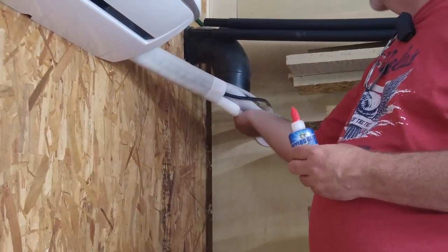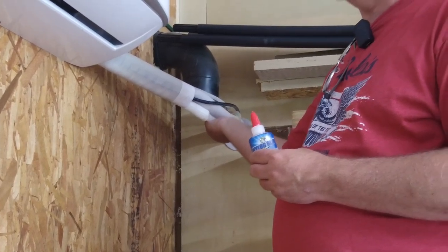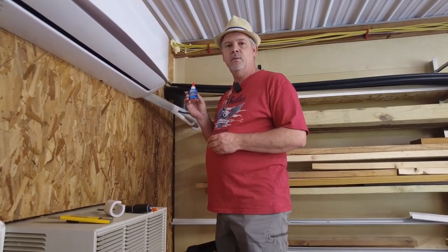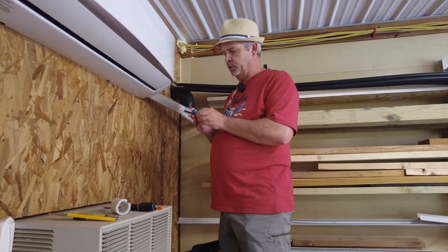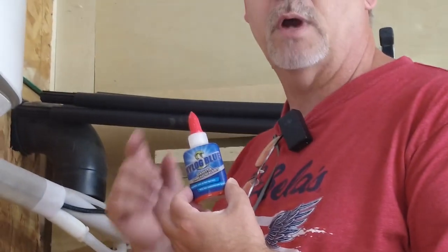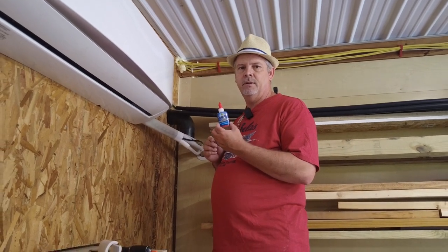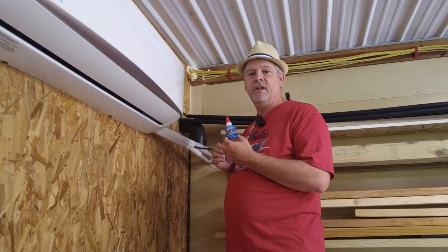We want it to be up, so I'll tape it up to where water doesn't get stuck down there, like that. Now when I put the two clamps together, I used a little bit of this Nylog Blue. It goes right on the end of the pipe, and then you put your pipes together, and this helps seal in case there's a little bit of discrepancy between the flanges.